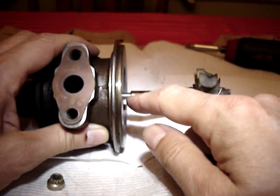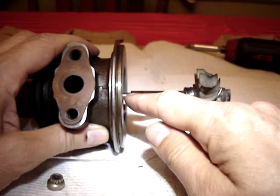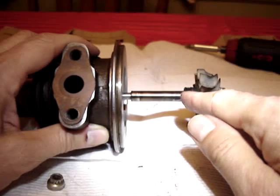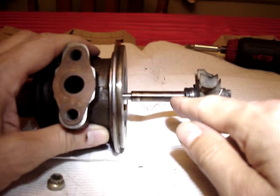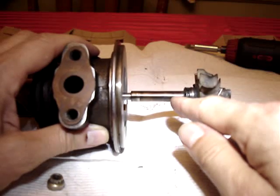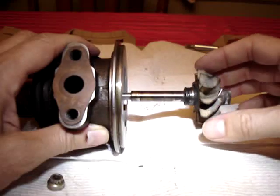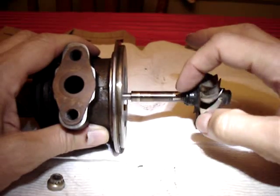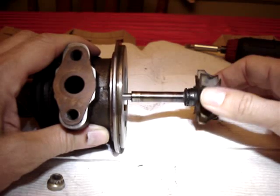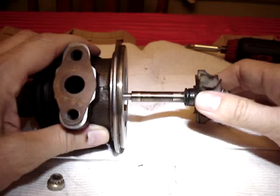The bearing sits just to the right of this lip here, and the turbine bearing sits just to the left of this lip here. You'll notice some pretty strong discolorations on the turbine bearing race over here as I turn this thing around. It's really rubbed in on this side, and then the color fades out to dark and comes back in on this side.